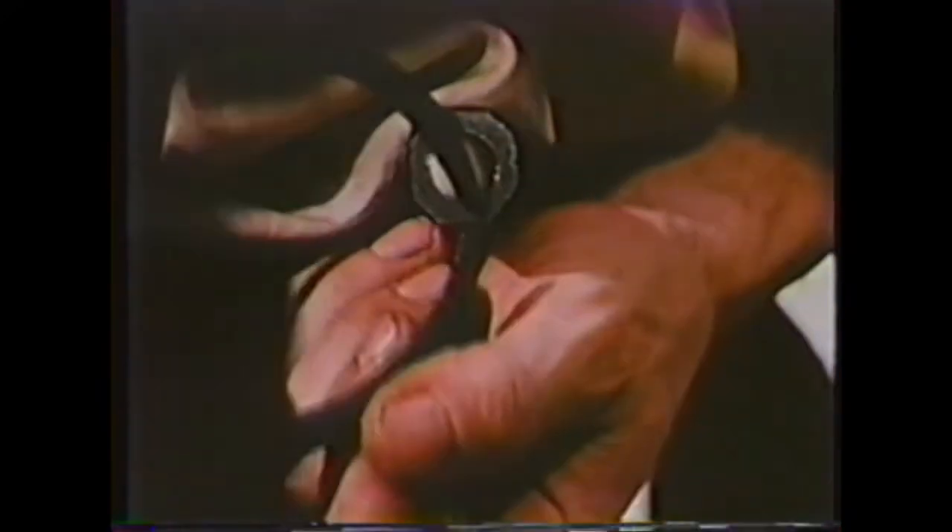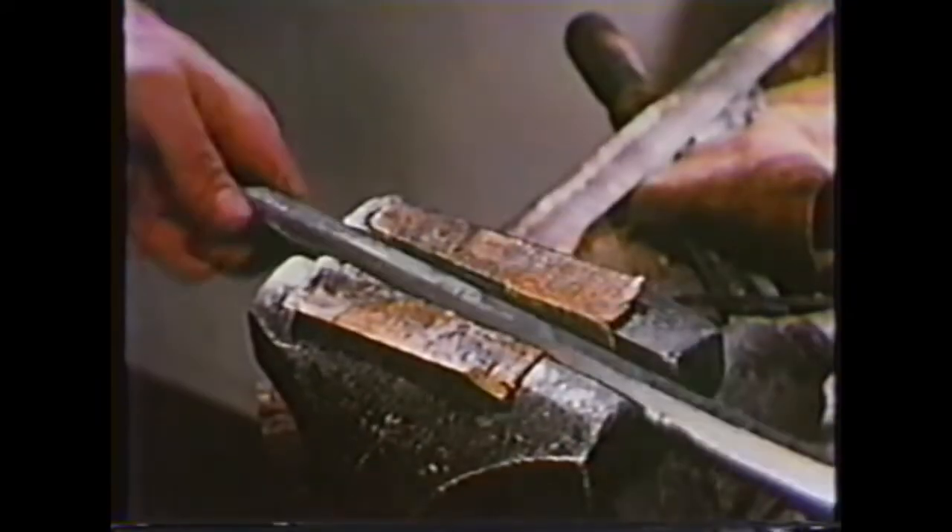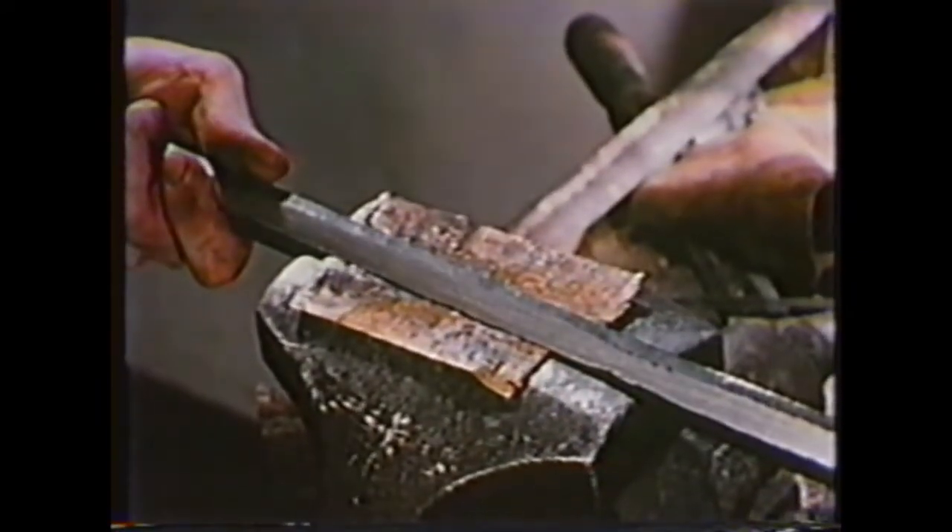To make sure that the flats are straight the file is used lengthwise so any humps can be seen. The muzzle end is filed even so that the hole is centered. We file the flats in pairs opposite each other — first four and then the four in between. The barrel is widest at the breech and tapered toward the muzzle. The last few inches are flared out, again for appearance. The bore is straight inside. Once the barrel is smooth filed, it is polished with emery — only the top five flats are polished.